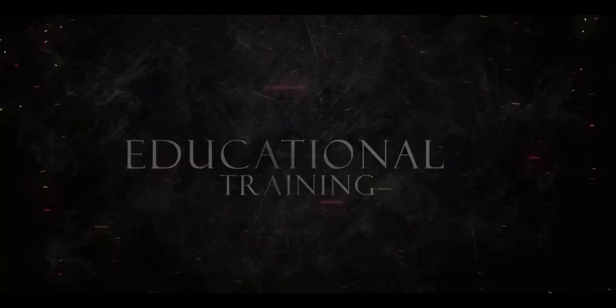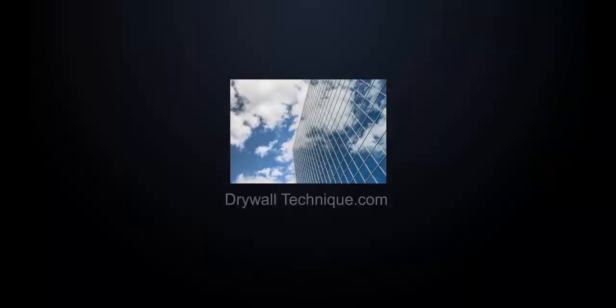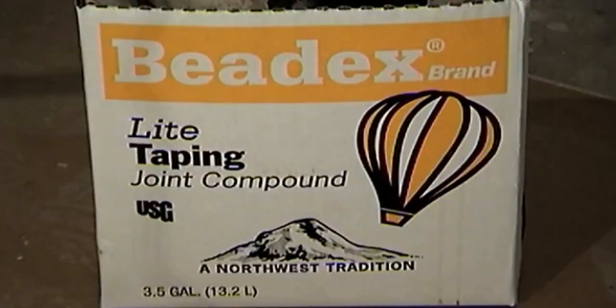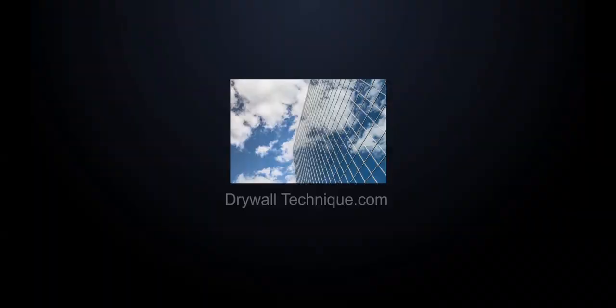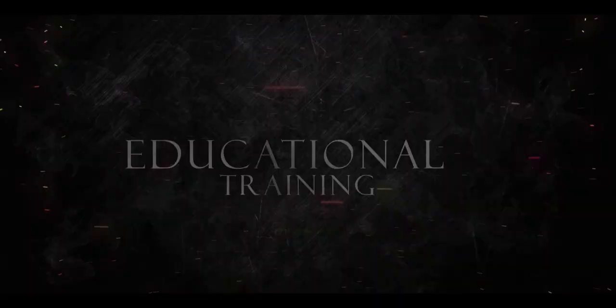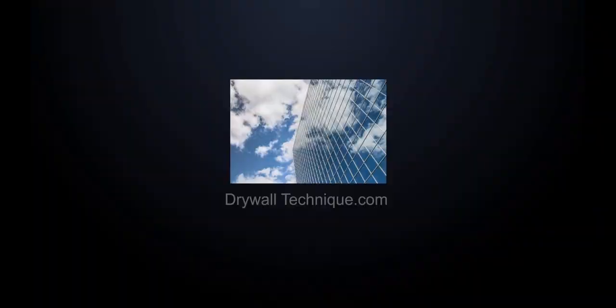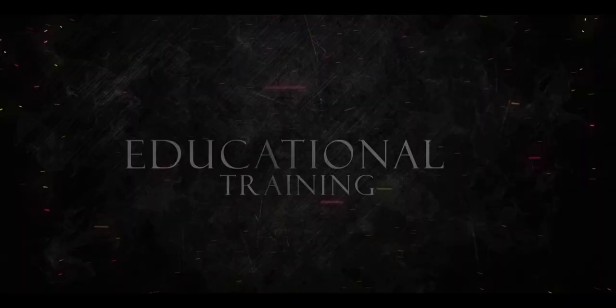We are going to concentrate on taping, so we'll be using a light taping compound that comes in a pre-mixed state. This will need to be thinned down for different applications. William likes to use BDX light taping joint compound. William will be using this taping compound for taping the butt joints, flats, and angles before he thickens the taping compound to install the tape on corner bead.